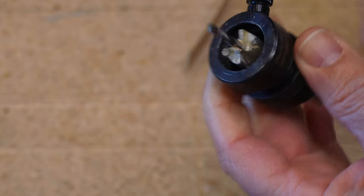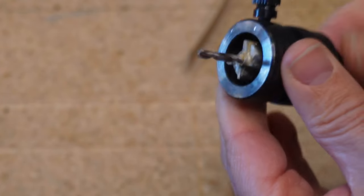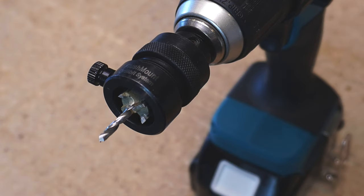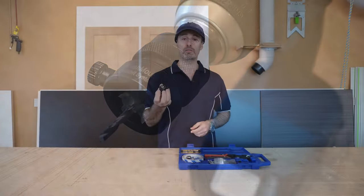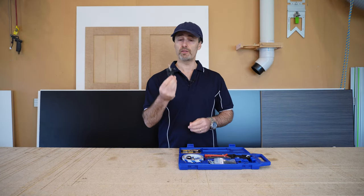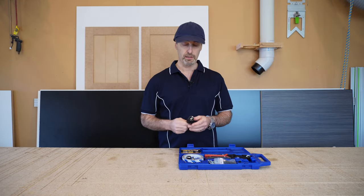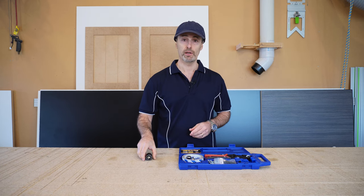It is adjustable, which is really good. Sometimes, in commercial stuff, you might use 2mm edge tape, a bit thicker. Well, this caters for that as well. You can adjust it. So I just thought I'd share this tool with you. I find it really useful in the field. And like I said, it just adds that little bit of detail to your joinery, having your screw caps finish flush.